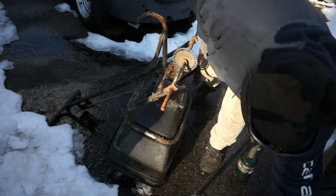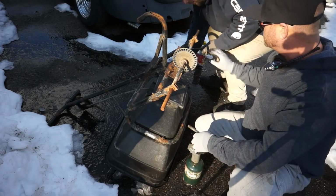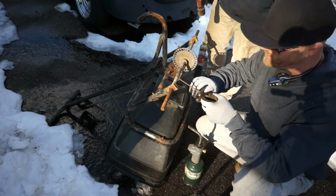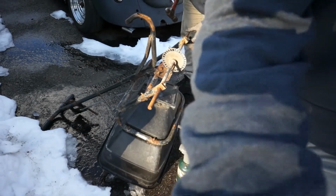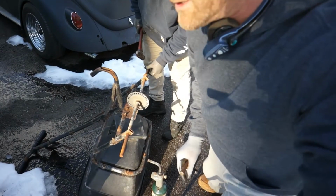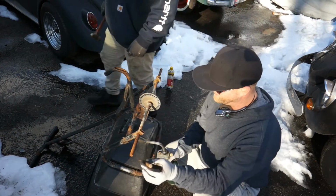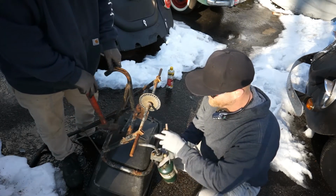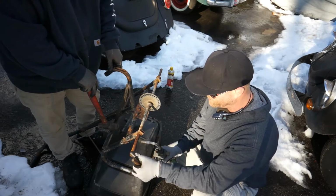June's got a ball hammer. He removed all the spacers and everything. He's got a pin and he's going to knock this set pin out. And let's move you guys a little straighter and see if we can go ahead and get this out of here. And I'm going to heat it up with this propane, this quick torch. Nothing here is plastic, so nothing's going to melt or bend. It's pretty thick steel.